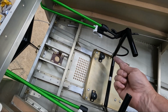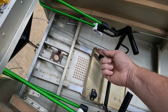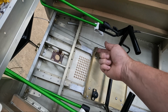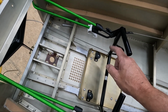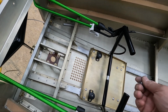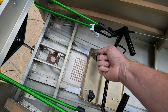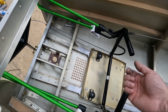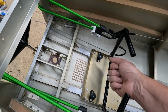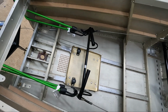Now the plans show that you have to put some kind of piece of metal wrapped around here to prevent the shock cord from eventually getting cut by this thinner aluminum, and they show the same thing up here on this steel bracket. Now what I tried to figure out is how to make something that would wrap around here but yet not fall off, because the shock cords on the pushed in pedal will actually become loose where it's pulling the opposite pedal tight, through the cable system.